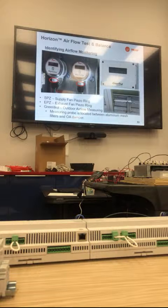Now, did you look at the other door right next to it? Sometimes they can't fit them all on the same door, so they might put them on different doors. But that's a good point: every unit should have 3 diagrams now, no matter what. You'll always have 3 wiring diagrams. If you don't have those, you're missing something. You may be accustomed to 2 diagrams, but everyone has 3, even if it's a small unit, just because one option may be put on a 3rd page, the way we have it set up. Yes.